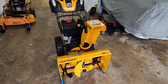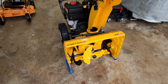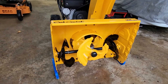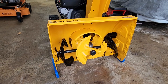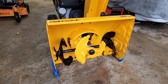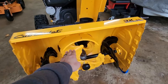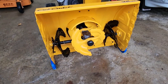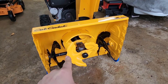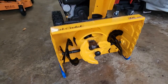I'll kind of go around and talk about my likes and dislikes. This is the three-stage — meaning you have your augers on the outside, which is your first stage. The three-stage simply replaces your inner augers and puts two sets of fans — they call them accelerators. You've got one here and one in the back, and then you have your fan in the back to push it up and out. That's how they get to three-stage.